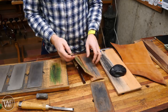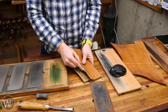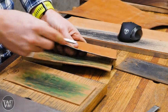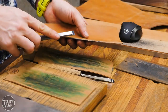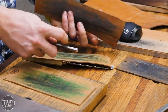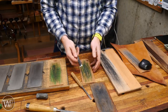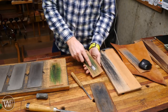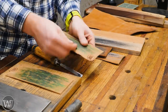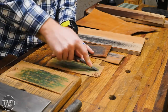Also for the V-tools, this one gets a little confusing — how do you get into that corner? Basically all I've done is use the very edge of the strop, charge that with a compound, and run that in on the inside of the V-tool just like that. It doesn't take that much. On this one I came through and shaved it at a slight angle because this V-tool is a little bit tighter, so you can run on the inside of the V-tool as well. Having them free-floating like this makes it very easy to strop while you're carving, because you have all these weird geometries — you can just pick them up and run them in your hand to whatever shape and size you have. I don't have to worry about having a wooden backer that fits that shape.